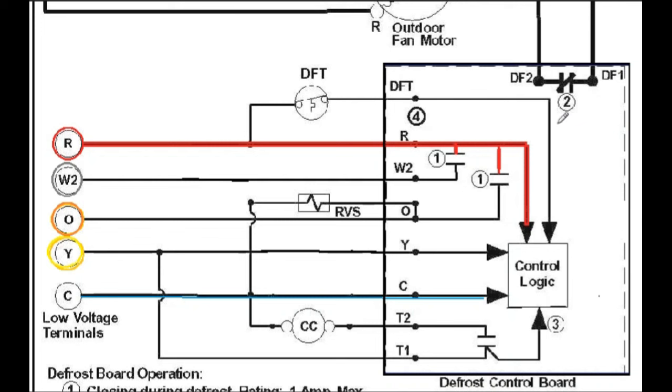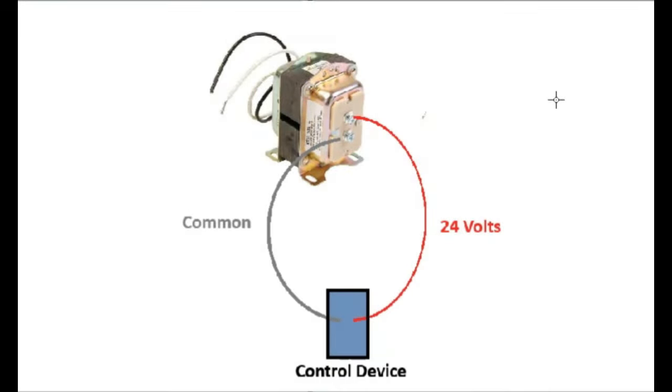What I have here is a schematic of a defrost control board that I cleaned up a little bit — I took the extras out that you're not always going to see in these systems. What you're seeing is brass tacks, bare bones. Everything we're going to cover in this video is going to be universal on all conventional split system heat pumps. All of the voltage in our system is going to be 24 volts AC, and no matter where you detect power — the indoor control board, the thermostat, the defrost control board outside — it all comes from the same place.